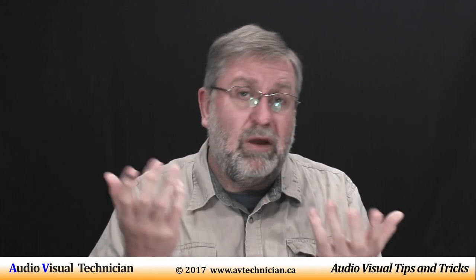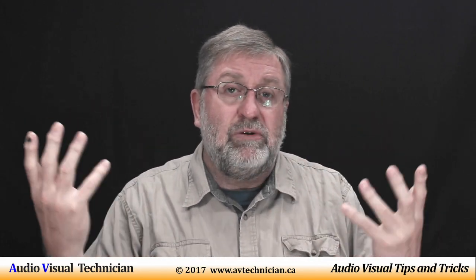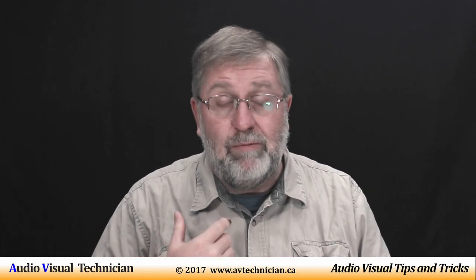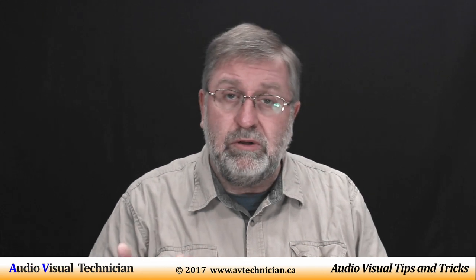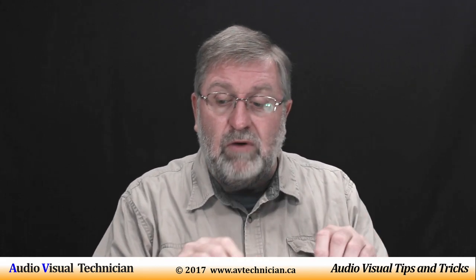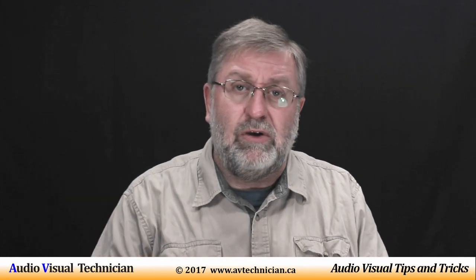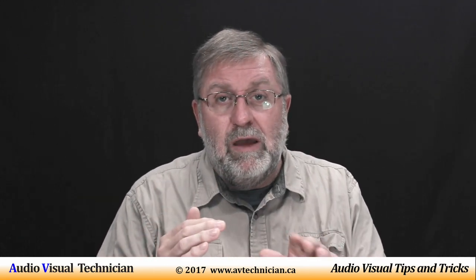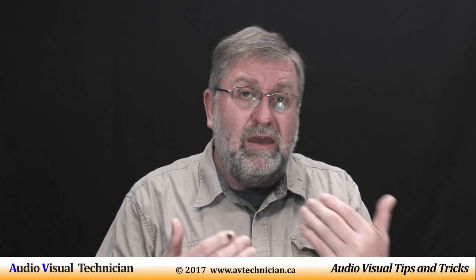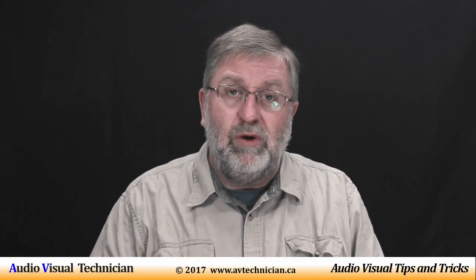You want to have your lapel mics, headset mics, hand-held mics, or wired mics all turned on so that all these microphones are picking up the sound of the room, and then you can find what frequencies are going to cause the most difficulty. I like it because a lot of the boards I work with are Behringer boards. I turn on the FBQ — a lot of my coworkers don't know what it does and it's often turned off — I turn it on, turn up the microphone volumes, and as I notice the channel squealing, I bring it down. I bring up a little more volume until it starts to squeal again, and bring down the ones that the light's on. What ends up happening is as I pull off the frequencies, I push in more volume than I'm actually ever going to need for the room. The advantage is that during the event, if I have all the microphones turned on, I'm hopefully not going to have any squealing and feedback issues. So FBQ really helps me determine it.